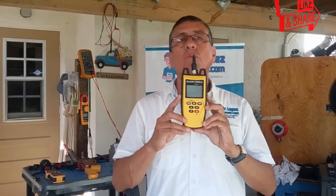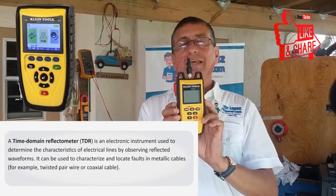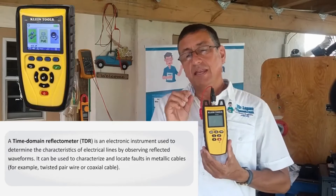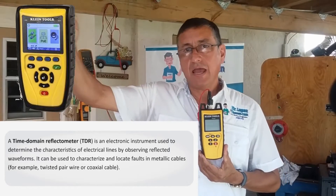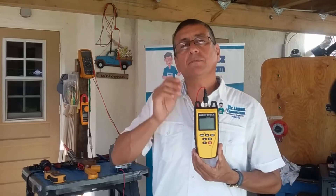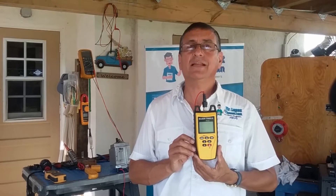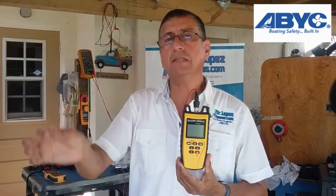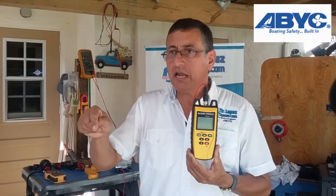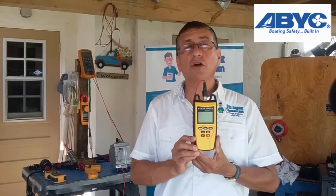Another widely recommended equipment is the Time Domain Reflectometer. This equipment is excellent to identify, in a specific wire, where it is interrupted — from this point to the end of the wire, at what specific point it is interrupted, or at what point the resistance increases or decreases. For example, you can say: this circuit is open 17 feet from this point. You follow the cable 17 feet and find the open, or find where the wire is burnt and the resistance has increased.